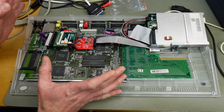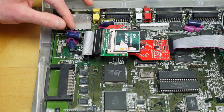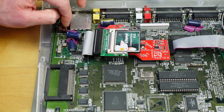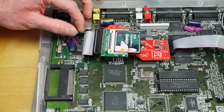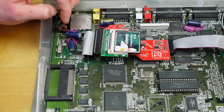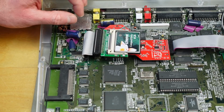The other thing that is super obvious, yeah, these things here. These are just regular electrolytic capacitors, good brand Panasonic, that I put in here instead of the ones that were in here originally. And as you can see, I didn't have the low profile ones that you need for this job at the point when I did the recapping of this. So I just used bigger ones, which are rated for higher voltages and things like that.